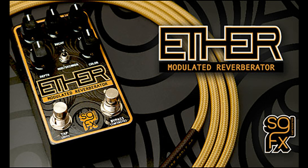Sawtooth, sine, and special waveforms are available via center-detent depth control. The pedal also features True Bypass with Trails Switching, Modulation Bypass and Speed Ramping, HP-LP Color Control, and top-mounted jacks for ease of pedalboard mounting. Made in Montreal, Canada, and powered by a regular 9VDC PSU, center-negative 2.1mm, with 70mA current draw.